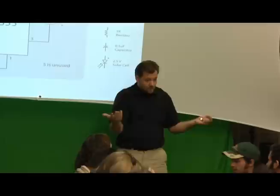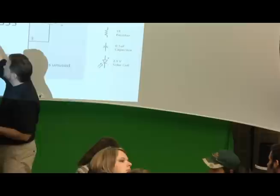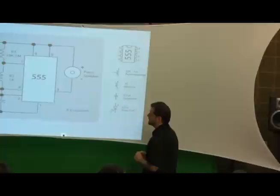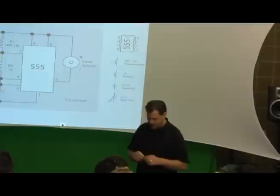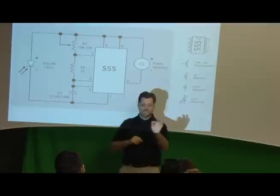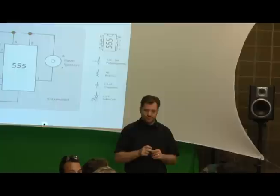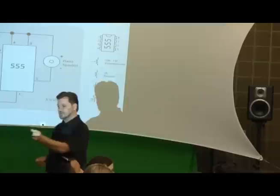And we've got two different kinds of resistors. Right here is a typical resistor. That's one of these little guys. And then this is a variable resistor, which is this potentiometer, okay? So we don't have to worry about the technical aspects of it just yet. What this is showing us, though, is that this resistor has to be 1K, 1 kilo ohm, and I'm not going to make you memorize the color codes on these, because I don't even have them memorized yet. But you'll see on here that it's got a brown, a black, a red, and a gold color on this.